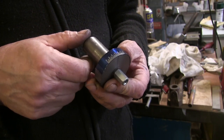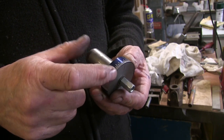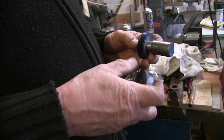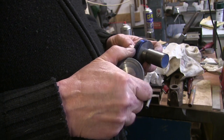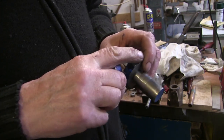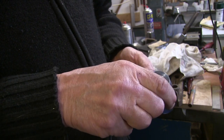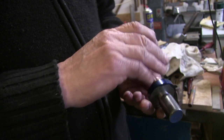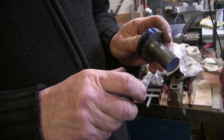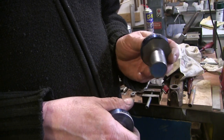That's the second one done. I've only got 60 degrees on this one because it'll be set in the middle and it'll only need to go 30 degrees either way. They should be somewhere like that when they're on, when I get them joined up. I also milled a little flat on the top of this, just so I can register it, in case I need to mill this off at a right angle with each other — just so I've got a register on there. I'm glad that bit's done because that's a bit long and boring, but necessary.